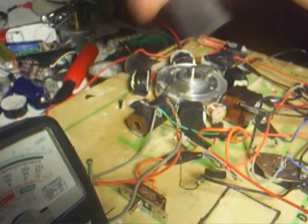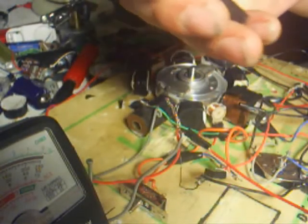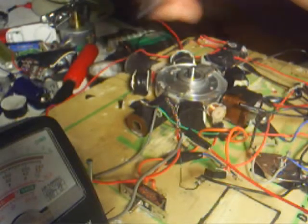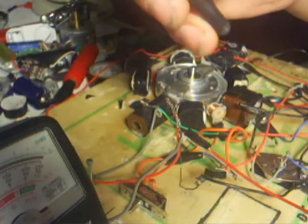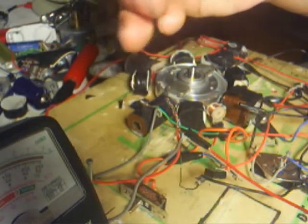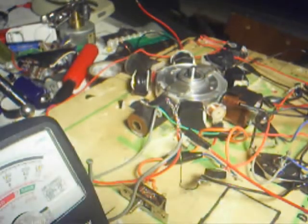These are all air cores, but I have some different ferrites I can add in them. Adding ferrite to any of these coils decreases draw a lot. What I've noticed is adding a magnet to the core can help reduce cogging — but really what it does is change the inductance of the generator coil. You either generate more or less. When you generate less, there's less Lenz effect and the rotor goes faster. Reverse the polarity and it inducts more, causing more Lenz and slowing the rotor.